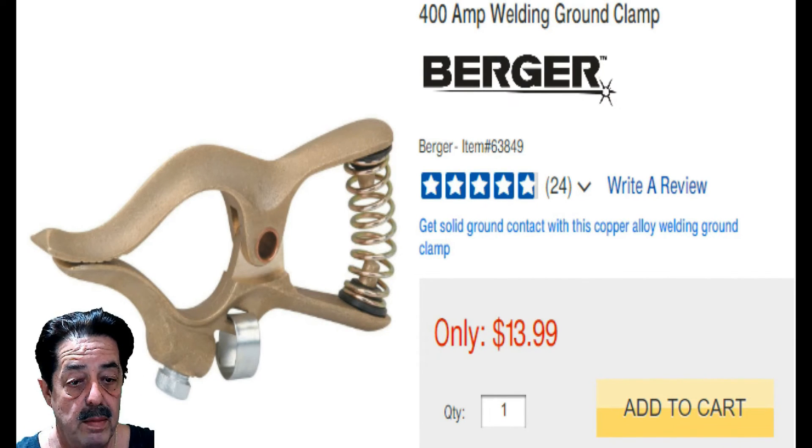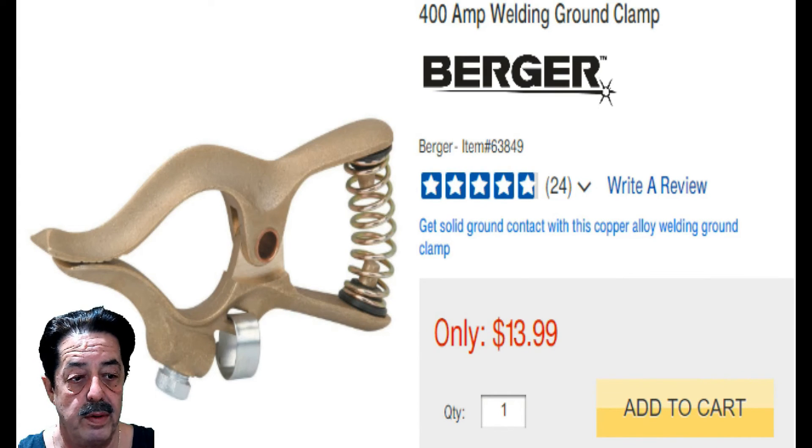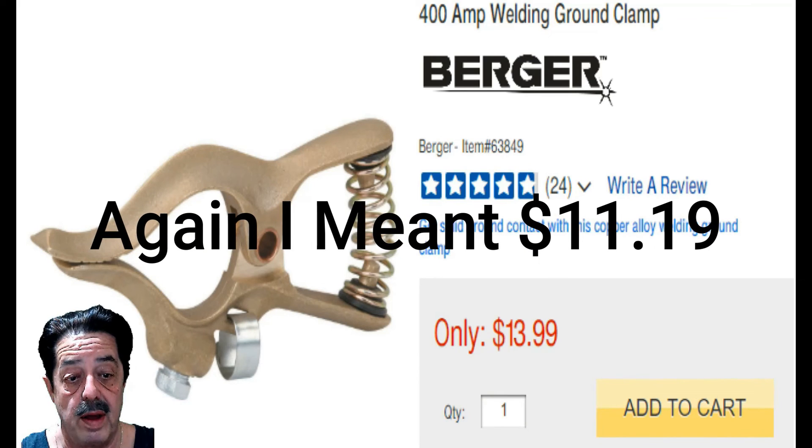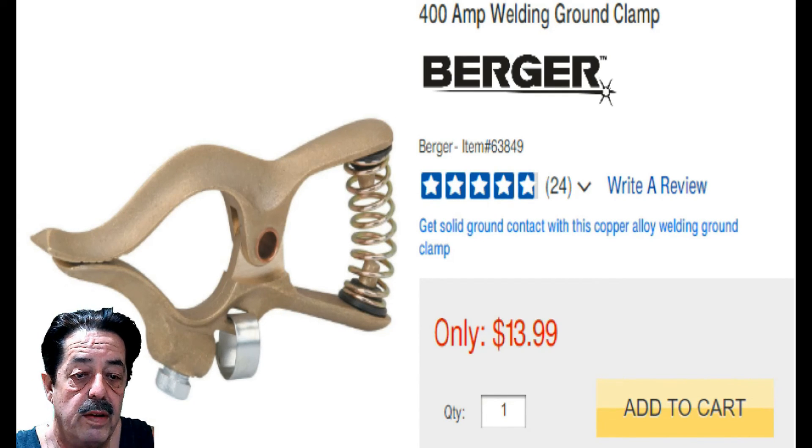To summarize: I'm the Home Handyman — please click subscribe, follow me, and drop a comment below. This is a solid tip for anyone with an arc welder, MIG welder, plasma cutter — whatever has a grounding clamp. If it's that flimsy jumper-cable kind, for nine bucks put a good grounding clamp on there and see if your problems go away. Even if it doesn't solve anything, you'll have an outstanding clamp that'll last a lifetime. Thanks for joining me — have a great day!